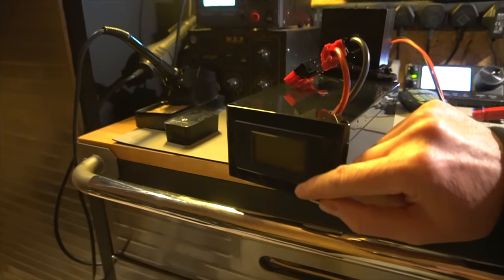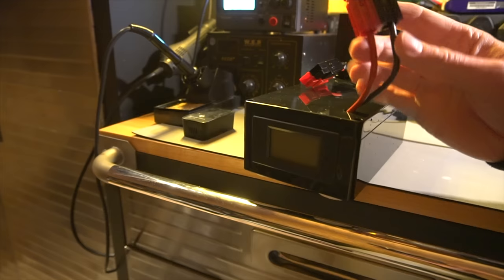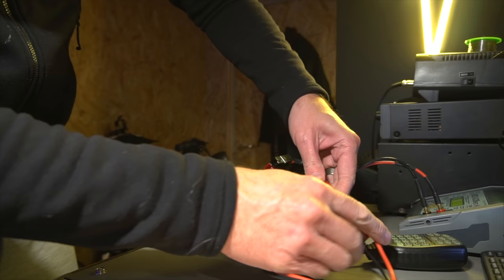I left the camera running to see where the battery actually cut out, and it cut out at 12.06 volts. That's basically three volts per cell — for a 4-cell pack: 3, 6, 9, 12 — just over 12 volts. That means all cells must be pretty much in balance, because if one had gone too low it would have cut off before the others. So all cells are hitting that low point at about the same time. The 3-volt cutout works on the BMS — great. The display turns off too when the BMS cuts out, and there's no way to turn it back on without reconnecting to the charger.